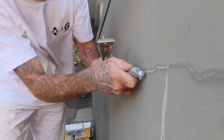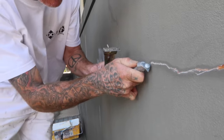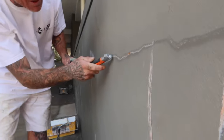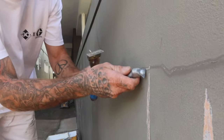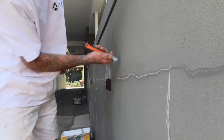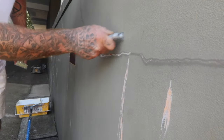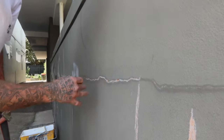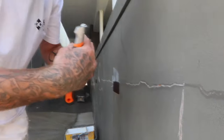What you want to do is just go through the crack. It's a very similar process to what we do when repairing a gyprock wall or any other surface. We always want to dig out the crack first. You don't want to go too deep — just a couple of millimetres in. Always go up first and then down, smoothing out that surface so when you fill it you don't have to sand too much, and you make a nice clean edge so the filler won't come out.